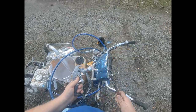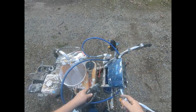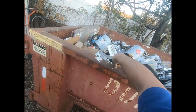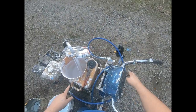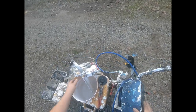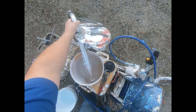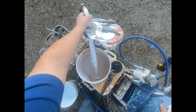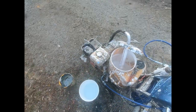This machine has double guns, so we've got to flush out both guns at the same time. What we're going to do is turn the pump on, rev it up, turn it on, and we're going to pull the suction tube out of the paint until air pockets come out. Wait until it starts spluttering a little bit — a couple pumps, that's it, we're done. All the paint's out of the pump.